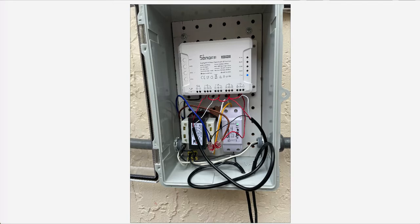I'll try to put a wiring diagram below, but it's very simple. Basically the Sonoff gets fed with the 220V directly, and then these two black cables are the cables coming from each of the valve actuators. You use the first two zones to move the valve in one direction and then the other direction, and the same for the other two zones. The valves have three wires — a common one that you hook to one cable from the transformer, and the other cable from the transformer completes the circuit.